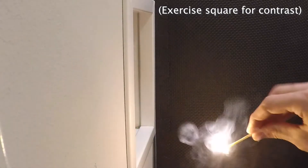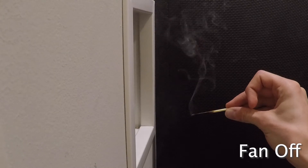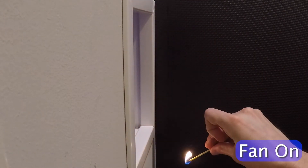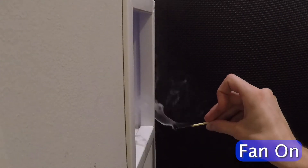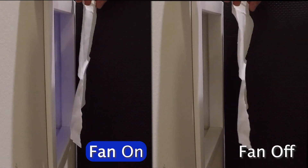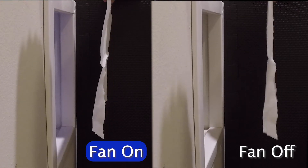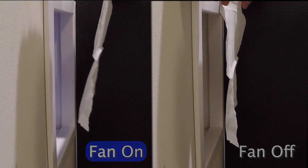All that is up and working, but it doesn't matter if we can still smell the litter. I can demonstrate that there is negative pressure produced at the entrance to the litter box. This negative pressure — where air is drawn from the hallway into the litter box — is important because smell travels on air currents. If air is being drawn from the hallway into the litter box, it will be very difficult for any smells to escape. Technically, for maximum odor prevention the fan would run 24/7, but that would waste electricity and conditioned air. For us, only running the fan immediately after the cat uses the box has meant we never smell anything.